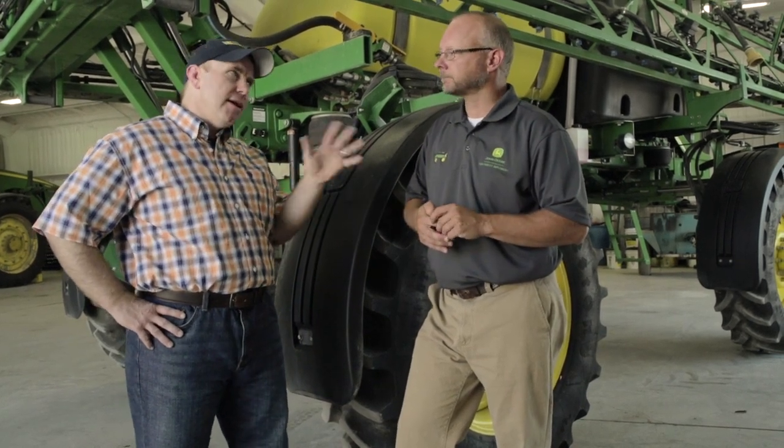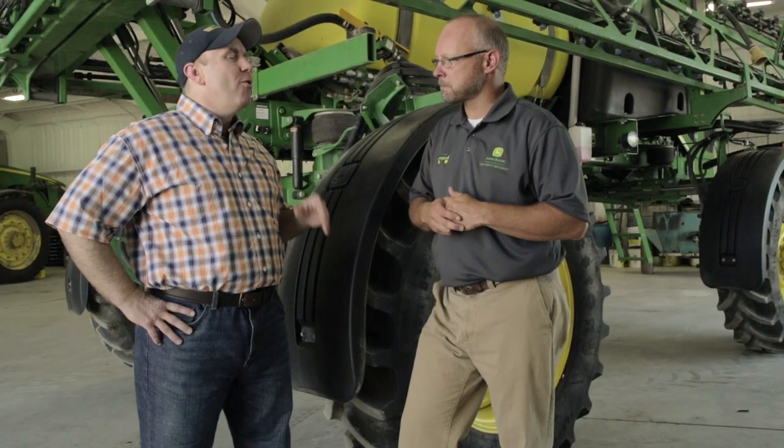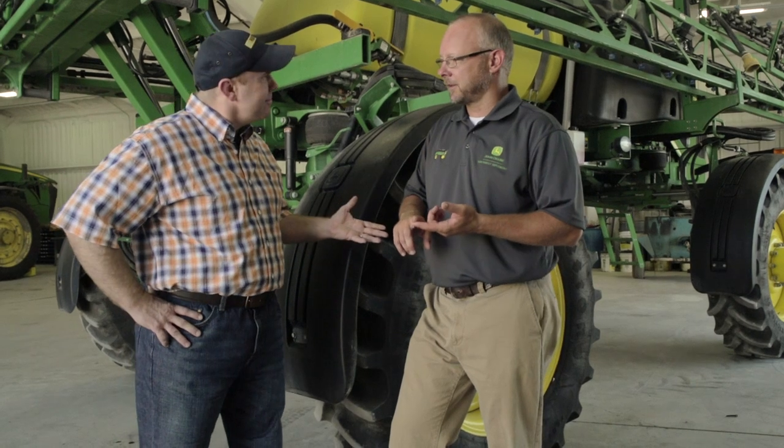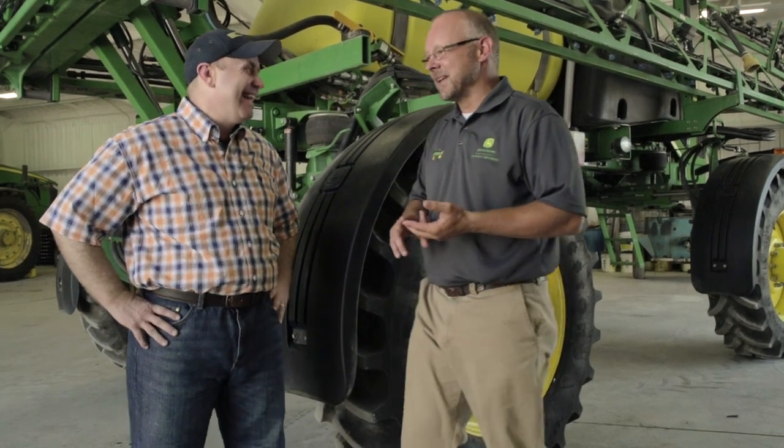So if I'm going five miles for a good stretch and then I'm going 20, I may need to make a new selection — you might need to take a look at it. So applicators are coming to you just before spring season for advice. What information do they need to have for you to properly advise them? The first piece of advice I would give them is come to me early, not the day they're going to the field. Does that happen? Every time. Some things I like to have them bring are the rates they're going to be running, ground speeds they want to run, droplet size they want to run, and what their carrier is — whether we're spraying water or possibly liquid nitrogen. Those are all pieces of input I can put into my monitor and calculate to make sure I'm going to have a good, even application.